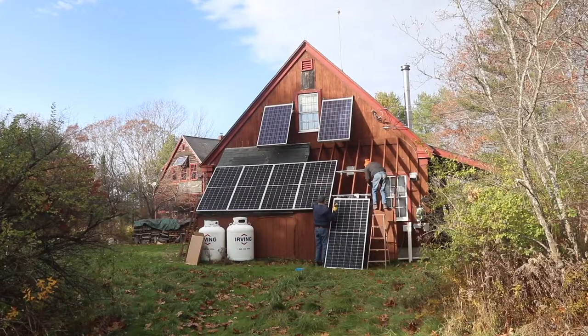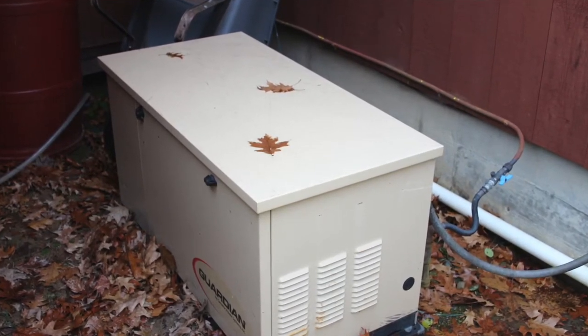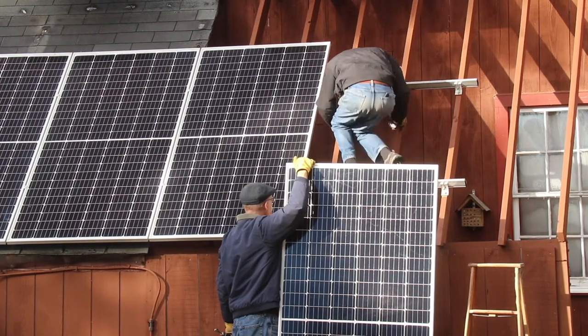The primary goal of this solar installation is to try and get me off of propane. I have disconnected the propane heater except as a backup, so there's no longer any solar contribution to the building from a solar thermal standpoint. The propane is there strictly as a backup. The other reason I have these tanks here is for my automatic propane standby generator. This solar installation is entirely grid-tied, so if the grid goes down, all of those solar panels have to shut down by federal law so they can't feed power back into the grid.